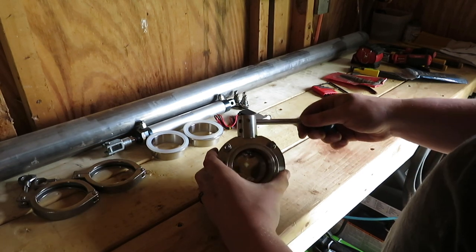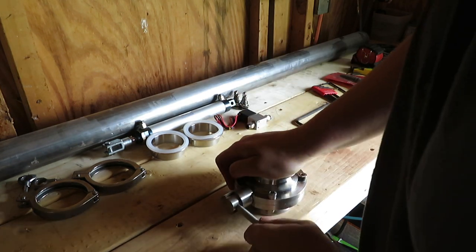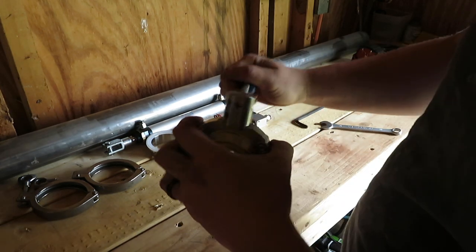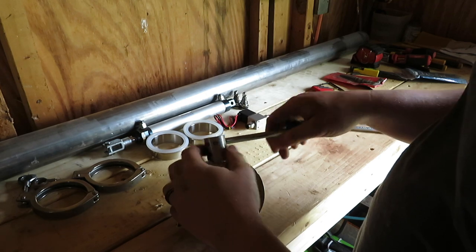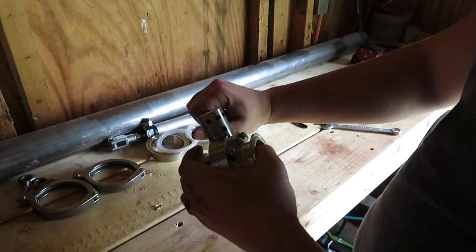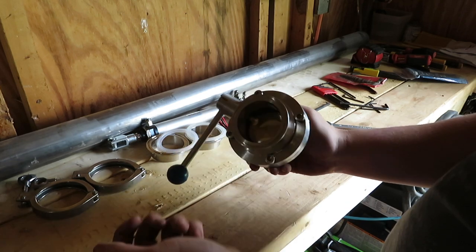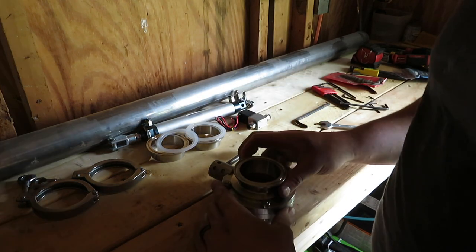What I want to do today is deal with this butterfly valve. It has some dumb safety feature where you can't turn the handle or open or close it without pulling this thing — it has a locking mechanism. I want to pull it off completely because we need to fix the pneumatic piston on there and we can't have this thing on there. So I'm going to pull this completely apart, little clamshell, and eliminate it entirely.